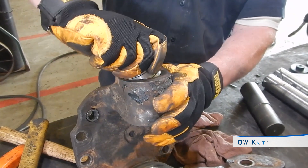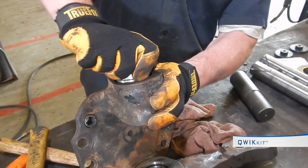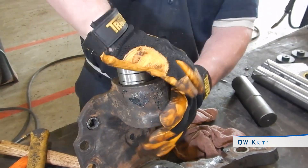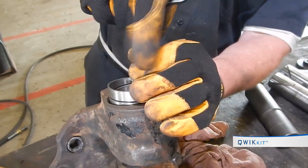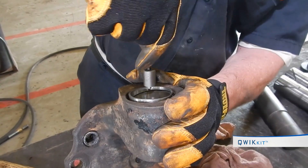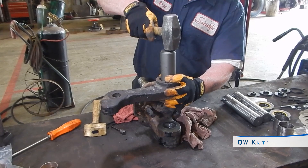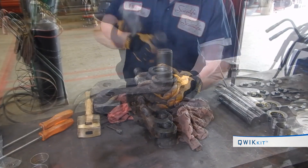To install the bushing, take one end of the spiral steel bushing and start it into the bore at a slight angle. With a clockwise twist and gentle pushing action the bushing will enter the bore. Twist the bushing as far as you can by hand, then with the Stemco Kaiser T-handle wrench grip the bushing — avoiding the bushing tip — and continue the clockwise twist and gentle pushing action until the bushing is as far as possible into the bore.